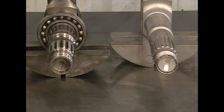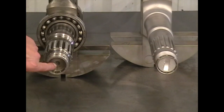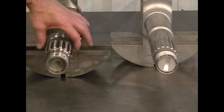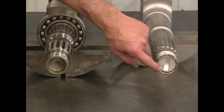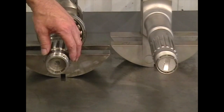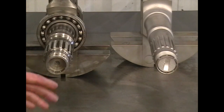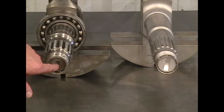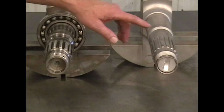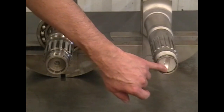Here's a front view of both crankshafts — tank crank on one side, aircraft on the other. On the tank crank, looking straight down the center, there is a machining center drilled in — it's a solid crankshaft, just one big solid chunk of steel. The aircraft shaft has a removable slotted plug in the very end — it's a hollow shaft, much lighter. Even when the tank crank was modified as a Gulf Coast conversion, it still had that machining center. So the easiest way to differentiate: look at the end of the crankshaft — tank cranks, even if modified, will always have that machining center, and aircraft shafts will always have that plug.